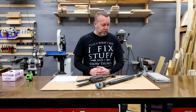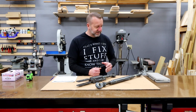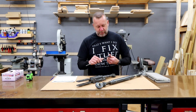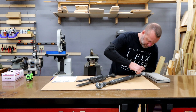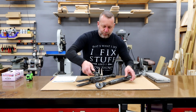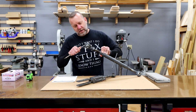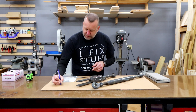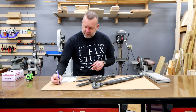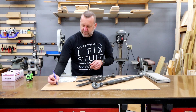The first thing we are going to do is take measurements of the holes for the pins. I'm going to use my digital calipers. That is 0.760, and I'm pretty positive the other end is the same. So those are three-quarter inch pins. Top is 0.760 — T and B for those pin holes.